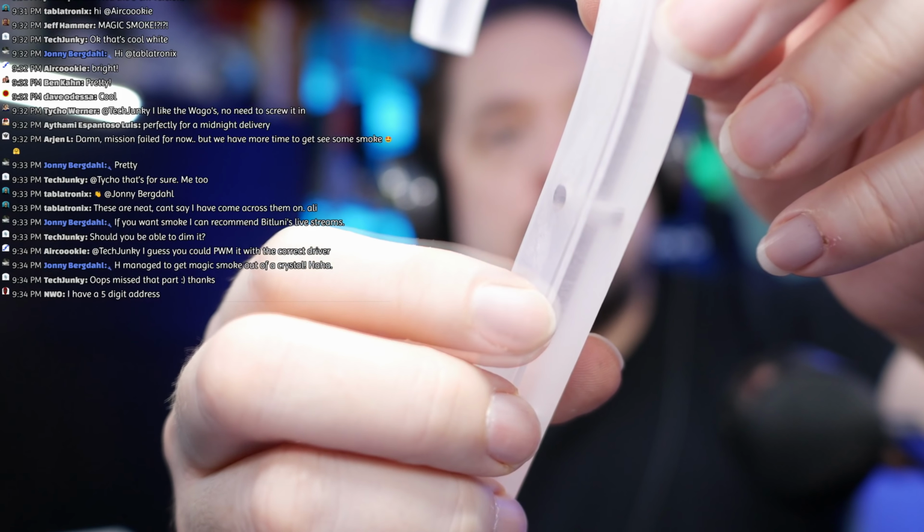Not sure yet. But they're 2020 LEDs, so instead of 5050, they're a lot smaller, and they don't use a lot of power. I have 2 meters of it, and they're the C variant, but WLED and the QuinLED boards and stuff like that can drive them just like any other WS2812 LED. So we have this. This is 5 volt, and it's fairly spaced together, so it's 198 per meter.